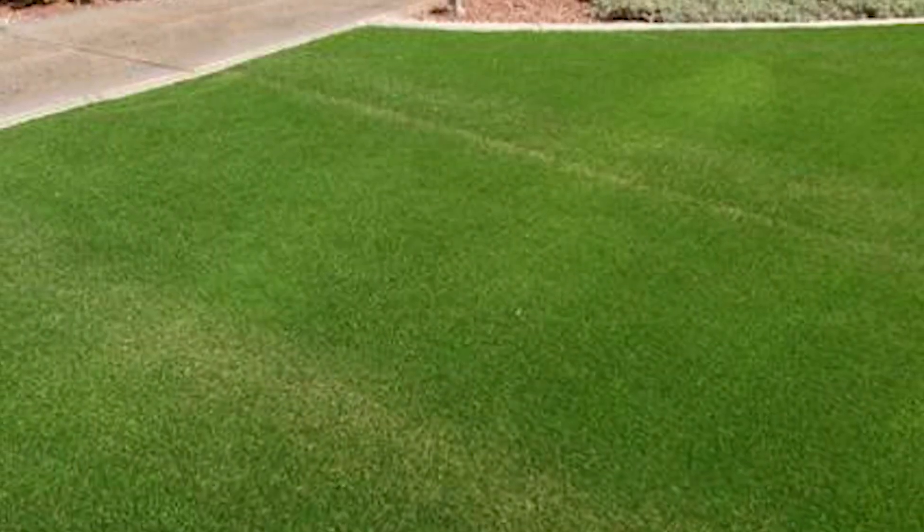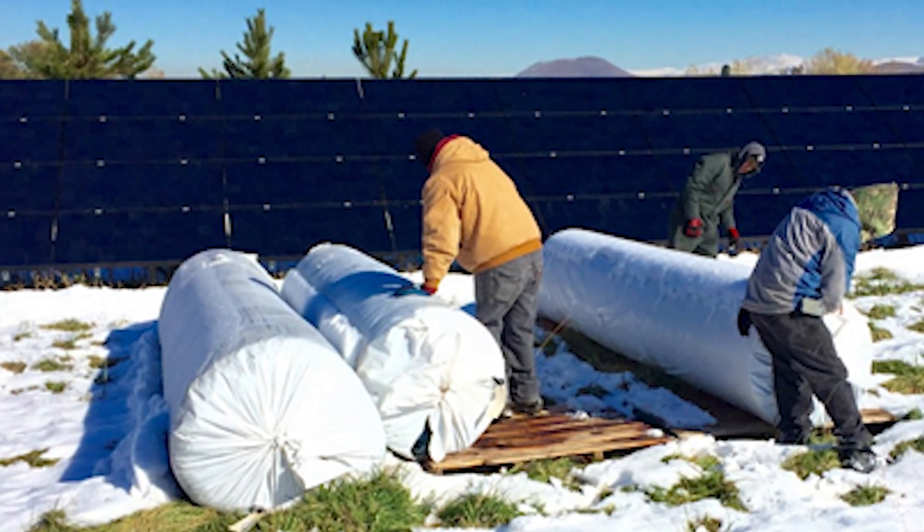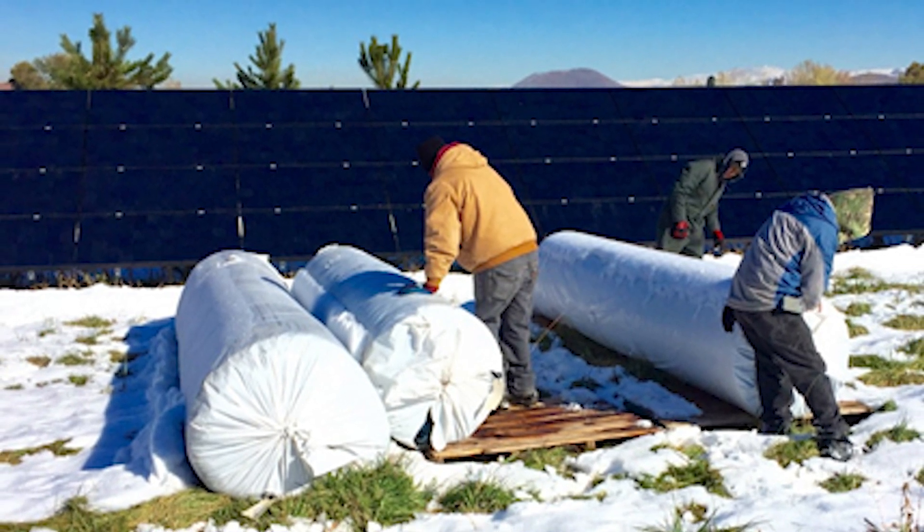In the cold months of winter, you must carefully transport and store synthetic grass rolls. Always store the rolls carefully so that freezing temperatures will not leave flat spots in the turf roll. If you have to store the turf outside, rotate the roll occasionally to prevent flat spots from occurring, and never stack multiple rolls for long periods of time.